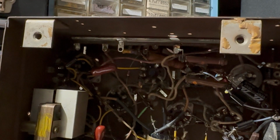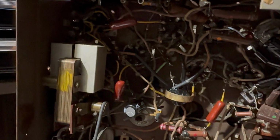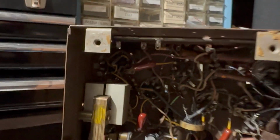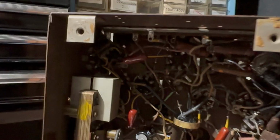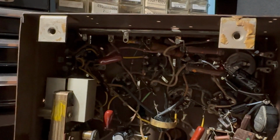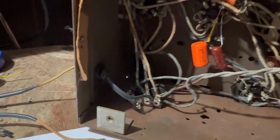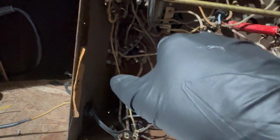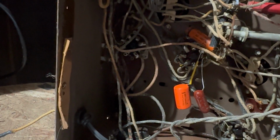Anyway, we are getting somewhere on this. Thank goodness. You can see what I did was I wired up this 2-section capacitor, which you can't even see, which is nice. I put this one in. I put that in. So the electrolytics, except for this mess over here, which, like I said, I'll probably leave, are low voltage. There's hardly any volts on them. And then I've got to change this across the line, or line bypass cap. And one more there and one more up here, which I'll do when I do the can dome. So we're getting there. Definitely getting there.